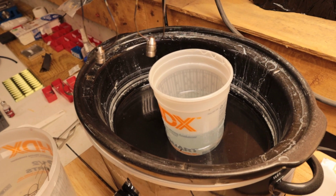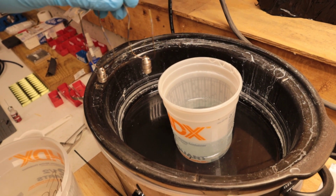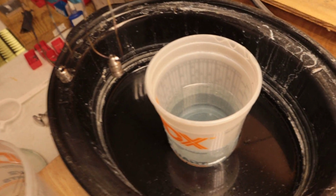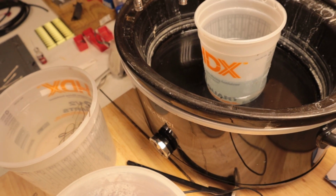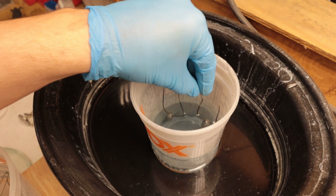Alright, so now we're going to do the etching, and obviously you don't want anything except titanium in the center, and you want it to be pretty warm. Basically you want to see bubbles in the etching itself. There's not that much because I just turned it on high, but it should be enough. So I usually do this for 10 seconds.